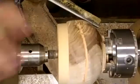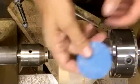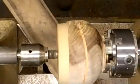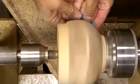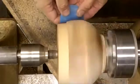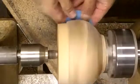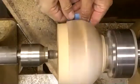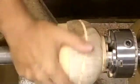And in this case, that wood's really pretty, so I'm probably not going to dye it or anything like that. And so I'm going to sand it now. So now is the time when I would come in, and this is obviously not the right sandpaper, but it's what's in front of the lathe here. But if you have a little bit of those holes left, you can usually sand them off. Okay, and we're going to go through all the grits, and we're going to make this really nice and finished.